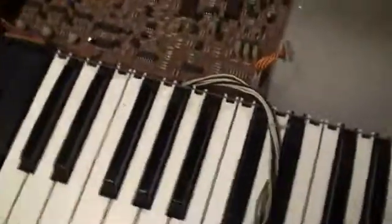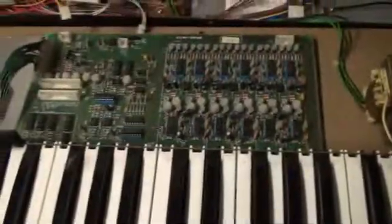If you were wondering where the knobs are, I carefully put them in the snap case a while ago. I have all of the bits and pieces that have been pulled off. So okay, cool — these boards are clear. I'm now going to get this key bed out; it's got some bolts underneath, I'm sure. And we'll go from there and take this down one level further.